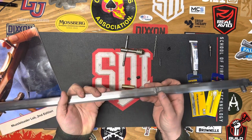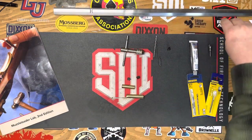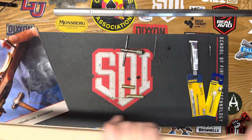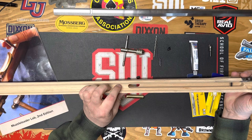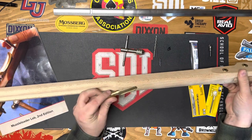They're oversized right now, so we'll file those just a little bit to get them to slide in there nicely. At the back of the barrel, we're going to need to use our Prussian blue inletting black compound to basically ensure we get this inlet into the stock. Otherwise, we won't be able to get the tenons in the right place. Once we do that, we'll be drilling down through the stock and into the thimbles.